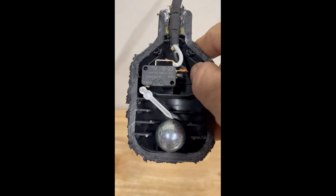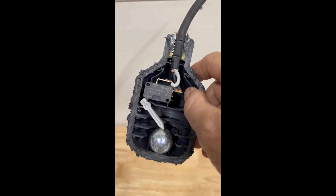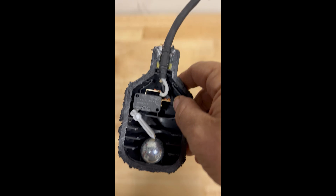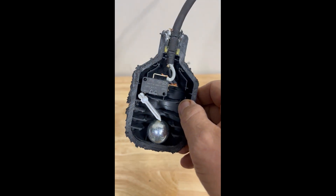There it is — it's starting to peek out a little bit there. This is how you can have a high water alarm on your system, but open the tank and see that there is no high water. It's because this switch is messed up and it's allowing voltage to go through those wires.